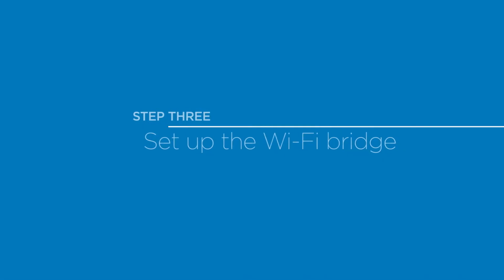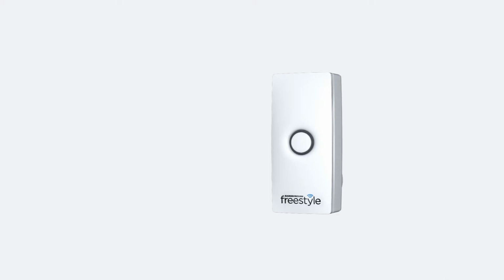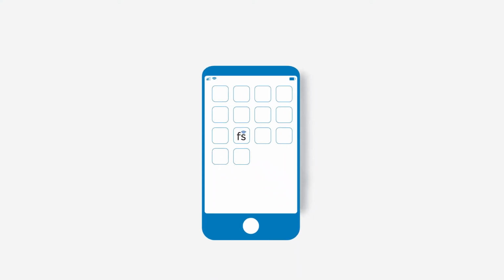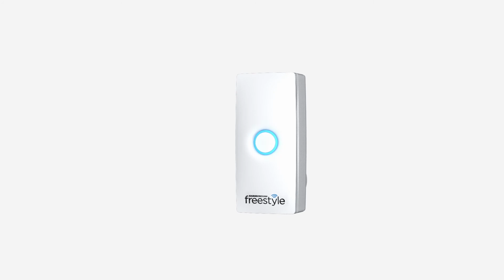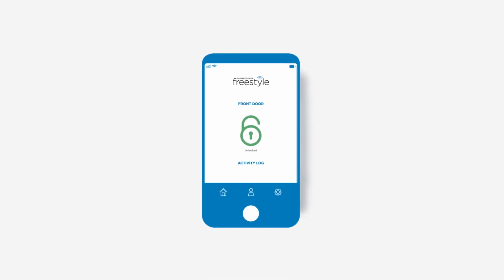Now that you have installed your door sensor, set up the Gainsborough Freestyle app and Wi-Fi Bridge to enjoy on-the-go connection. Download the Freestyle app from your smartphone's app store. Plug in your Wi-Fi bridge and wait for the light to flash blue. Log in or sign up to the app, then go to Settings and add a new device.